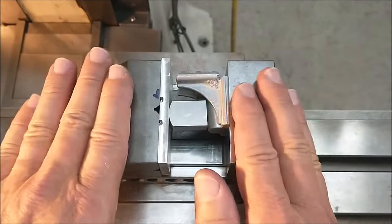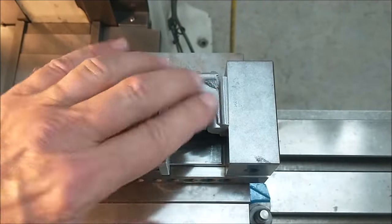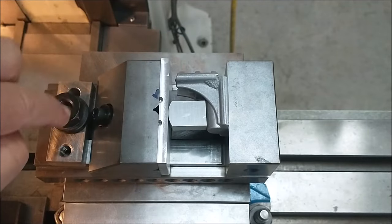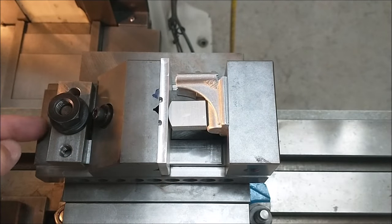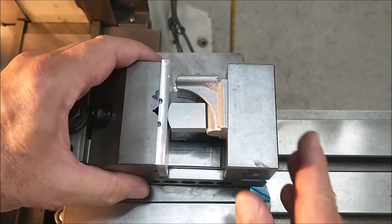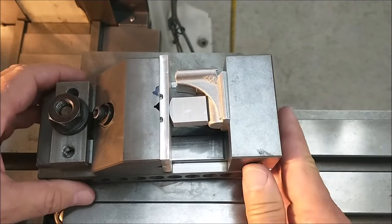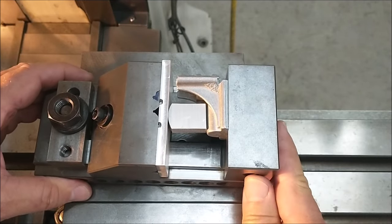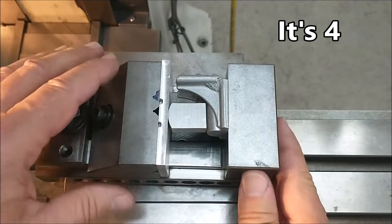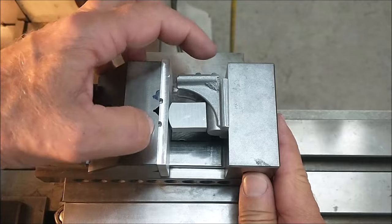The double vise itself allows me, there you go, earthquake, rotational control this way to bring this plane in true. And since it is strapped to a secondary slave plate, if I unloosen this nut right here, I can rotate this part this way. So I have full three-axis control over this part. Or maybe that's four. One, two, three. Who knows? Whatever.